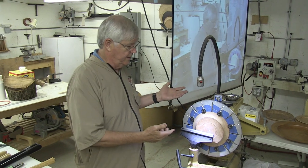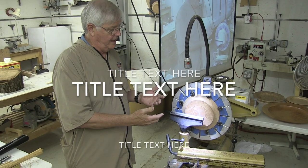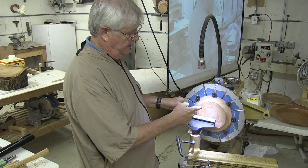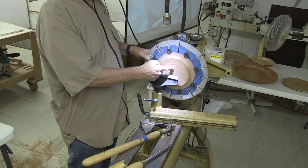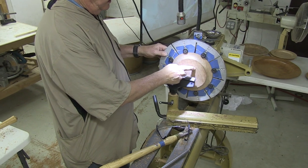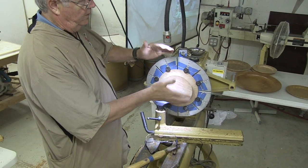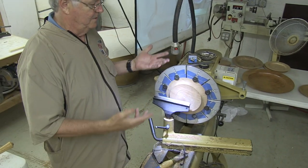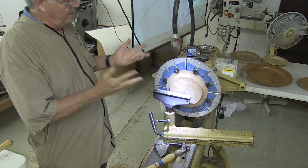Yeah, so after all of that, I come back around. I have a vacuum chuck, and I use it all the time on bowls, but this is easier. And it's a little imprecise, so you couldn't maybe tell, but I could, that when I'm scraping this dovetail out, well, maybe you can tell, actually. It's not the same surface that was presented from the original screw chuck. It's not quite the same concentric roundness, and I've cut into the surface a little bit here where it's skated across, so it's not oriented quite the same either. It never will be, I find. I haven't figured out a way to move from the front to the back orientation and have it be perfect. Hasn't worked in my world, so I'm not surprised that that happens.